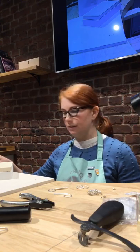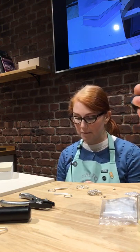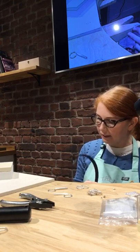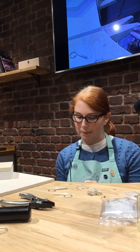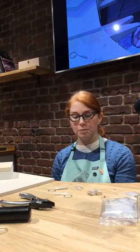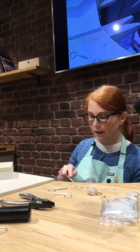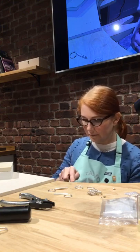And the other thing that you can do, I'm not going to do the whole lot, but your bench peg is customizable. It's your tool as well. Although it's sacrificial, I love putting, for instance, a little notch into this part of my bench peg, because I can jam all sorts of stuff into this little notch to stop it sliding and slipping around. So nice little notch there. That's how I hold a ring. I jam it in there and then I just push against it and it holds it nice and steady, instead of trying to hold it steady like this. I also jam bits of tube or round wire in and it keeps it upright, and you can push against it then for things like filing like this. Whereas when it's on a straight edge, it rolls around all over the place. So little bench tips.